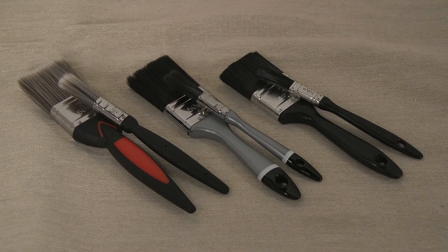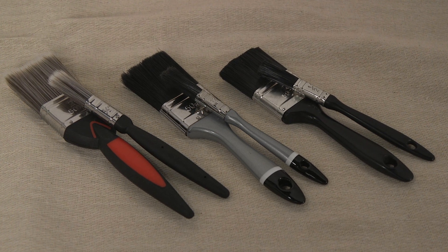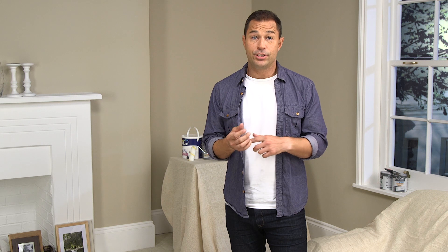If you buy a better quality brush, you will find the filaments are longer, making it easier to use and you're going to get better layoff from your paint. There's less bristle loss and the handle will have been designed to fit in your hand more comfortably, which overall will give you better control and help you improve techniques like cutting in.